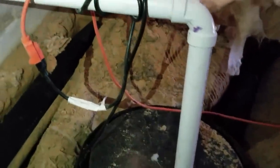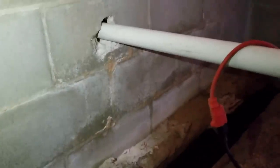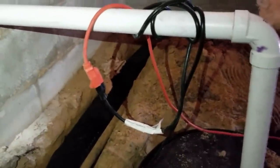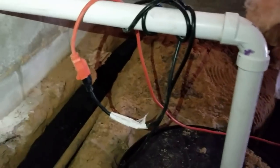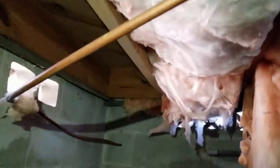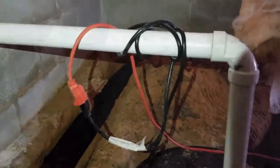Okay, so finally, on the sump basin and sump pump, remember that you do need a GFI outlet installed, preferably onto this wall right here, and you'll need an electrician for that, or you can do it yourself. When we install, we just put in a temporary extension cord, which can stay there for years and years. But when you go to sell the house, your inspector's going to say there cannot be a break from outlet to pump. So that means you can't use an extension cord. So a GFI outlet is needed. You can put it up here if you want, but they probably will put it up on the joist, and then you can plug the pump directly in. But don't forget that you need an extension cord for temporary power.